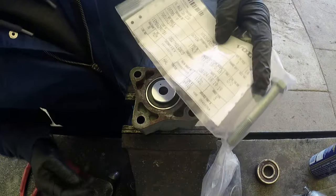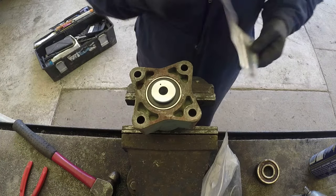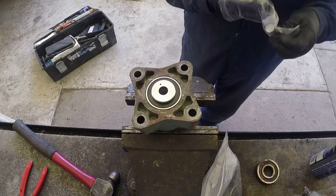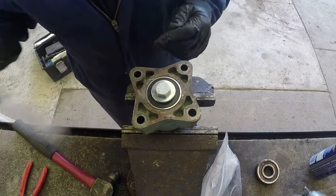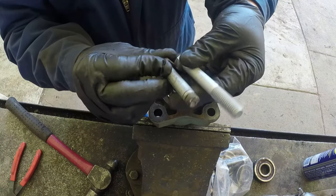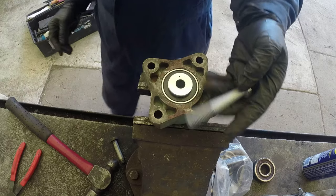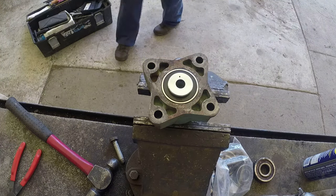Okay, here's the left-threaded bolt. This bolt originally broke, not this particular bolt, but the old bolt which came from the factory with the machine failed. It broke from metal fatigue, too much tension, too much force, and it failed. That bolt broke and took the radiator, a bunch of other parts like the radiator fan, a couple of hoses and things, and quite a bit of damage. But we're assembling all new parts.